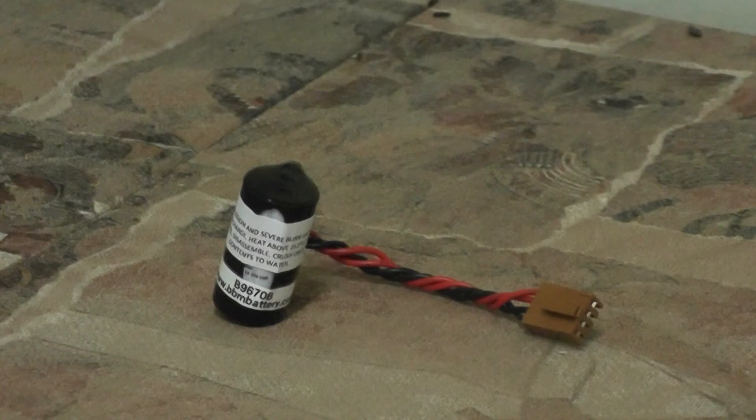Those are all series controllers, which is why they are basic numbers and letters, but this battery fits many different programmable logic controllers. This battery has a capacity of 3.6 volts and 1800 milliamp hours. It replaces batteries with part numbers 3G2A9-BAT08 and C500-BAT08.